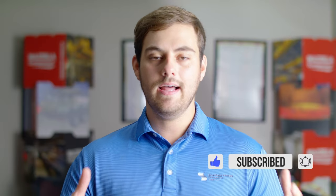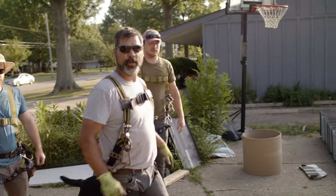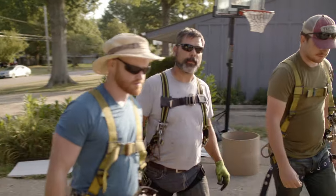Well, we're continuing our residential metal roofing install on Adam Mazzella's house. And today we are moving on to starting to install the panels, 1.5-inch Snaplock panels. Last week we installed perimeter trim, eaves, rakes, and valley metal. And today we are beginning to install panels. Matt Lane from Metal Construction Solutions and Installations is back with us, and he's going to be demonstrating the process from start to finish. So let's go take a look.